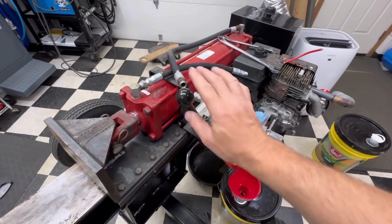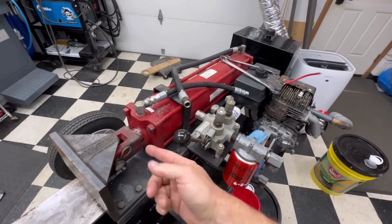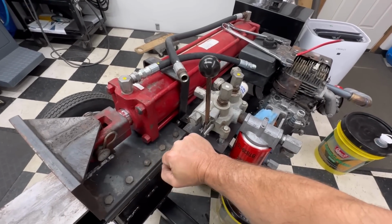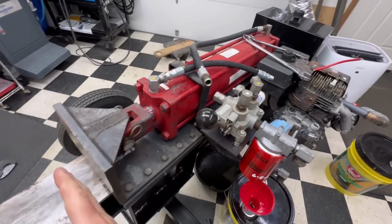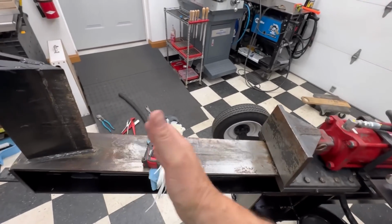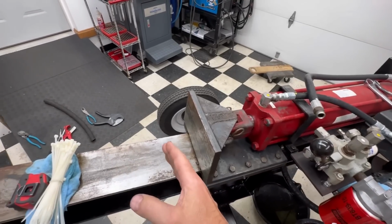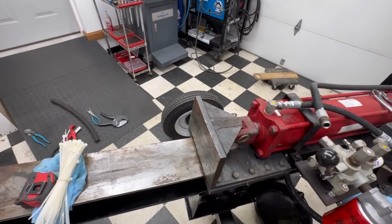and when it returns back, so if I've got it in the forward position, goes forward, and when the ram comes back, I've got it in a return position, and I'm going to have a bump stop at about 18 inches, so it bumps that and stops it every time at 18. So if I'm out splitting rounds up, and 99% of them are 16 to 17 inches, it'll always stop, and that'll be about 9 inches less that this thing will travel every cycle.